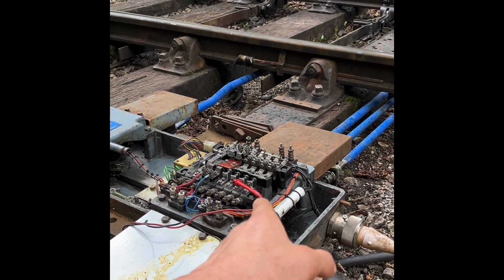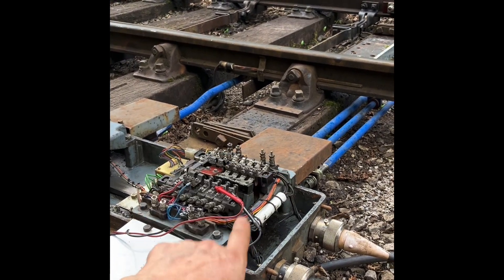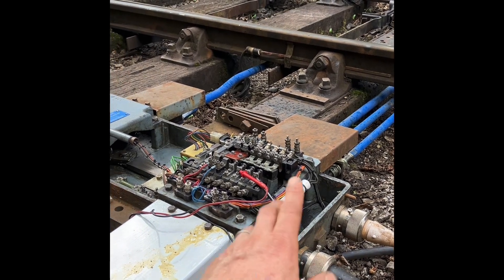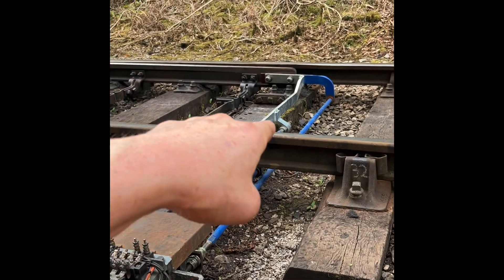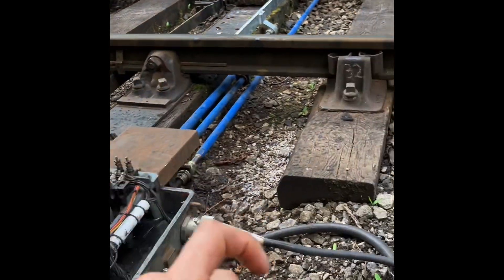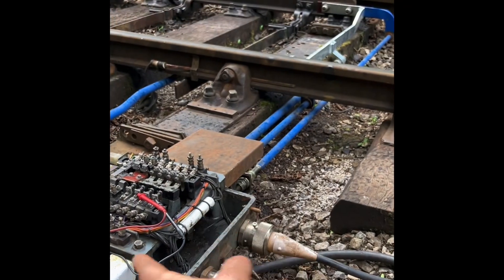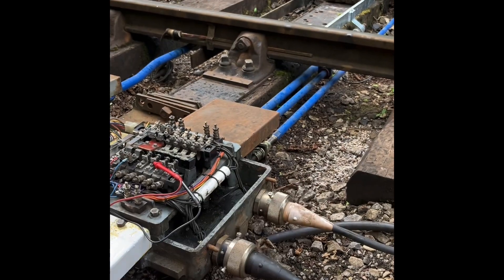Keep all your contacts clean, and keep the roller pieces clean. You will find a lot of grease gets inside these machines — even a tiny bit of dried grease underneath the roller will stand the rollers off. They're plastic rollers and that will also bob your detection. Same with the lock rods: looking at that nut, there's a collar either side fixed perfectly. The lock rod inside the machine has exactly the same setup — a large notch and a thin notch. The thin notch is the side you're locking up and the large notch is the opposite side. Once you put the machine over the other way, the other set of notches will line up: a thin notch for the close switch and a large notch for the open switch.